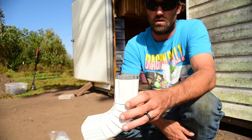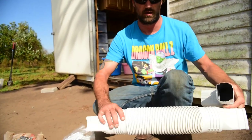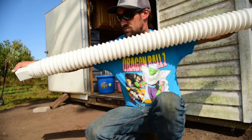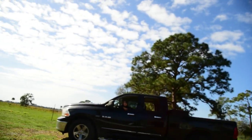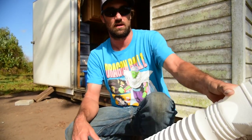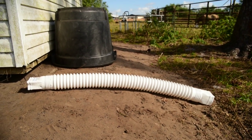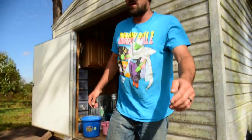This is your 90-degree elbow to kick your water away from your building, because we don't want water washing out the pad. We also opted for the extendable outlet - these extend up to 55 inches. They're made for the four-by-three or two-by-three downspouts and you cut off the excess. If you want to connect them together to make it even longer, you can. One is plenty for us just to get the water off the pad and into the grass. Now we'll start moving on to install.